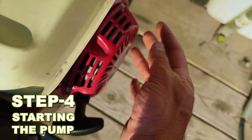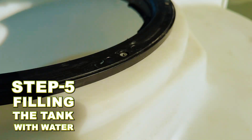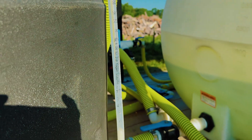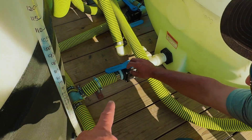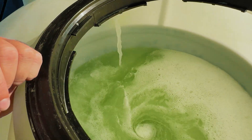It's a 10-acre task. I'm going to get my pump started and we'll start filling this tank. We're going to go half — clean water starts flowing into the tank. We have a gauge and you can see it rise. We're going to bring it up to about 50, then once we get there we'll start putting our chemical in. When we're there we switch that off — that's where our clean water is coming from. Now we open this up and it's circulating, then we'll start putting our chemical in.